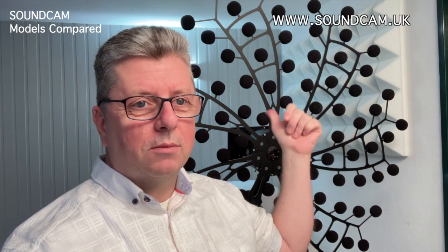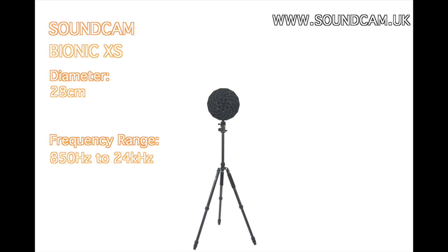We're using something which comes from finding airplanes in the sky or whatever, radar type technology. We're using the same mathematics. So we've got all these microphones, and the reason we're talking about the diameter of these things is because the biggest diameter of the microphones, the furthest spacing that you've got, determines the lowest frequency you can locate. So the smallest XS array has a diameter of 28 centimeters and a frequency range of 850 Hz to 24 kHz. So it's the lower frequency range due to the small size that starts at 850 Hz.